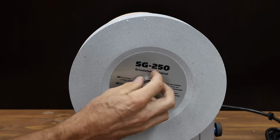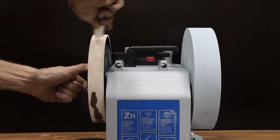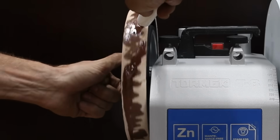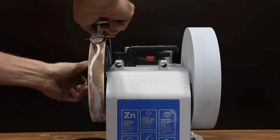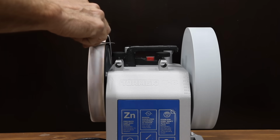When sharpening, the grindstone will automatically tighten to the right torque. Preparing the leather honing wheel. First, impregnate the leather with the oil included. Use approximately 2/3 of the tube. It'll soften the leather and cause the honing compound to penetrate. Apply a thin string of compound before starting the machine. Rotate the wheel by hand. Start the machine and distribute the compound by pressing a tool gently against the wheel. Let the compound penetrate the leather.